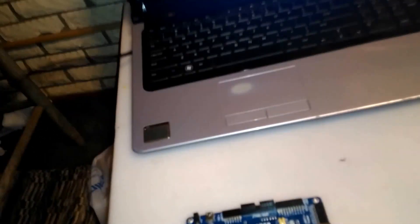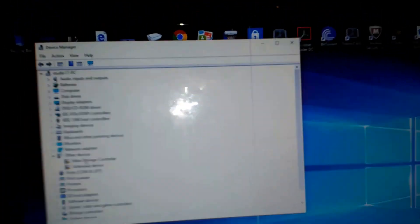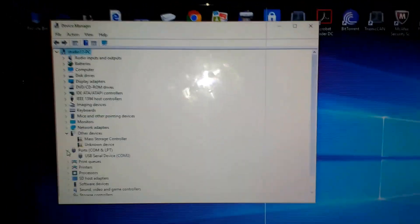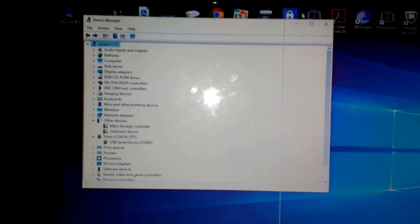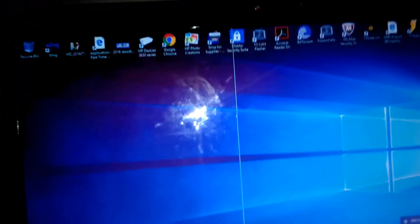Here's the board that we programmed in the last video. And we plug it in. It shows up under the ports there — USB Serial Device Com 3. But in this case, because we're on Windows 10, we need to disable driver signature enforcement. I just wanted to show you what it showed up as.